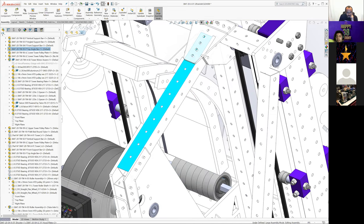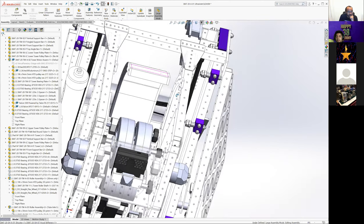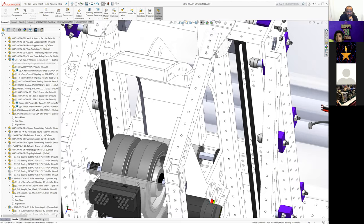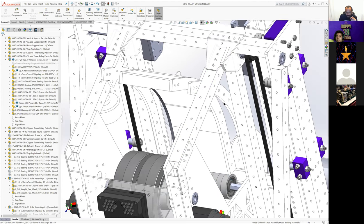But ideally, we probably would have done this a little bit different to be able to swap the hood easier. Right now, it definitely takes several people quite a lot of time to do a hood swap because there's a bunch of threaded rods going through multiple spacers out here on these ends so that we didn't have to print a super long part. It's possible by the end of it, we were just doing that and printing the full gap to make it easier. Because right now you have these Lexan parts on the outside, you have these 3D printed parts, and you have these little 7/8 spacers with 3D printed parts on the inside. The part count just got really large as we were building this up. So I would not do that the same way again if we ever did it. None of the spacers are shown in here.